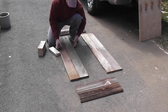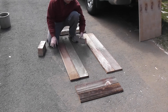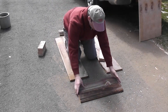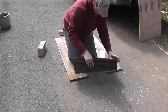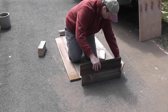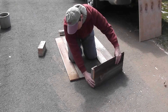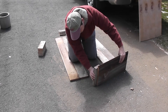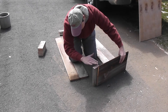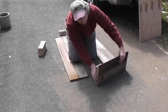As you can see, the tongue and groove is still working — it fits together nicely. I cut some 2x4s down so when the sides come up, this will add support, because the wood is thin and cedar, as you probably know, is really soft. These will go in the corners like that, and I always cut them a little bit lower so if I want, I can put some soil on the top, because I don't really like the look of these, but they're necessary structurally.